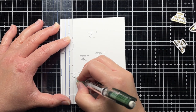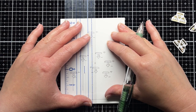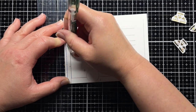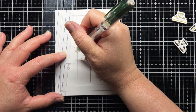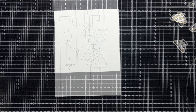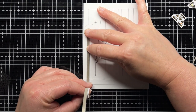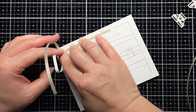I draw a vertical line from the battery along the left side of the panel and crossing over the score line. I draw a horizontal line across the bottom of the panel, then vertical lines from the negative point of each stencil triangle to the score line. Next I draw a vertical line from the top of the battery along the left side of the panel and then horizontally across the top, connecting the long flat side of the stencil triangle to the top line. Once everything is drawn out, I adhere conductive fabric tape to the panel tracing my drawing. I usually try to use as few pieces of tape as possible and will fold and bend the tape around corners as needed, but you can simply cut pieces and overlap them. You can find another video showing a more detailed look at applying fabric tape.